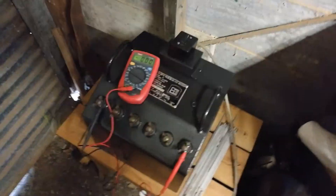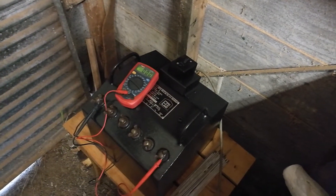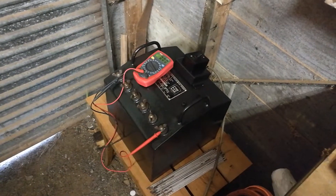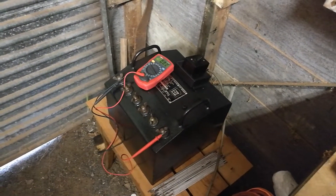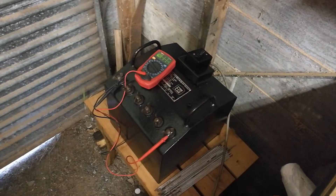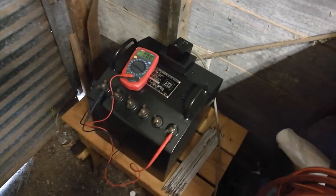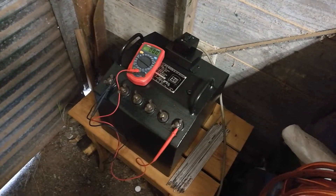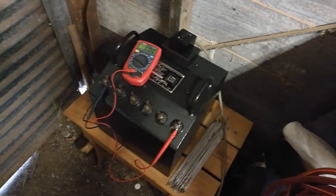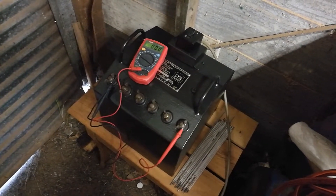When I want to turn it off — done. This welder never originally had an on and off switch on it. Some welders do, others don't, but I like the idea of having one at the welder. If I want to put my gear down on the bench and don't want to accidentally put the electrode down on some earthed metal, I can just turn it off, adjust my work, and turn it back on.